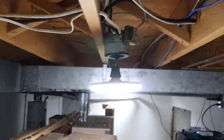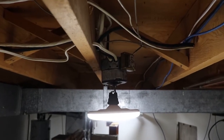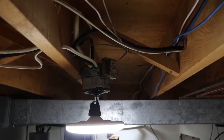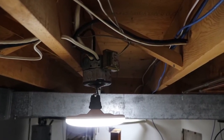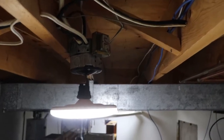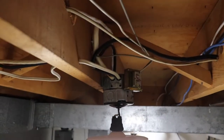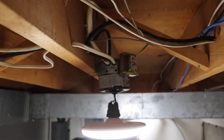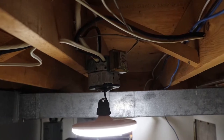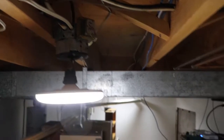Over to this box, because the box is what had the power in it and not the light switch, if that makes any sense. But this junction box had like 9 different circuits going into it, and it was just way overcrowded, so I put a box extension on it so that I could work with it. And I took out a really gigantic Marette in there that was still not rated for the number of wires under it, so I took that out and put some Wagos in there and took care of things. So that's a bit of extra work if you want the on-off ability.